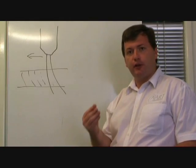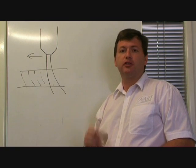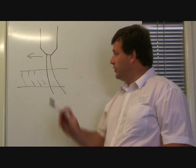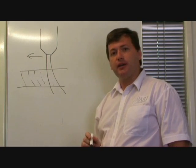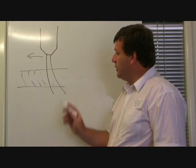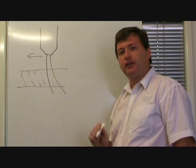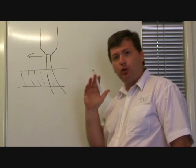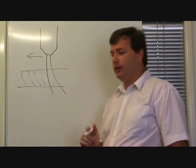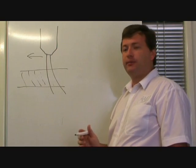Probably one of the most difficult things to do with a plasma cutter is to cut accurate holes. Now, the trailing arc effect that we just discussed has quite a bearing on this problem. The reason is that when you're cutting a circle, the machine's continually changing direction. It's almost like you're cornering continuously. Remember the corner we drew earlier, how it had that cut underneath?